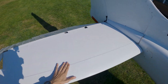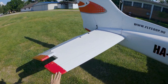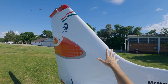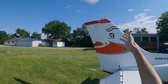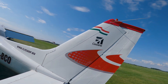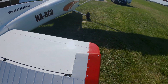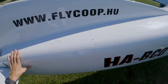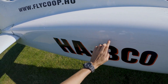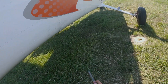We shake the horizontal stabilizer again and confirm there is no visual damage and all edges are smooth and clean. Then we inspect the fin itself — it looks fine — and double-check the VOR and navigation antennas that provide our ILS and VOR connections. We repeat the fuselage inspection from the right side, confirming no dents and all panels are set.